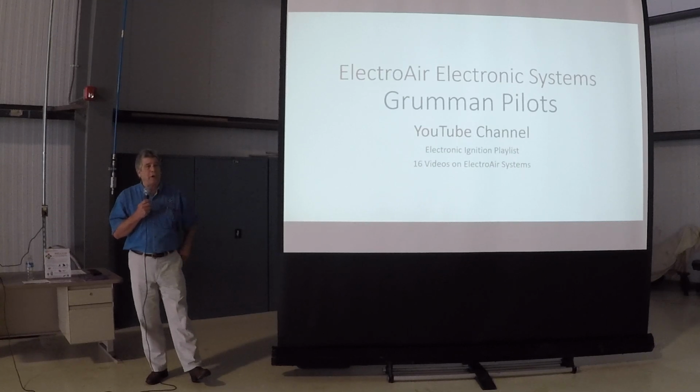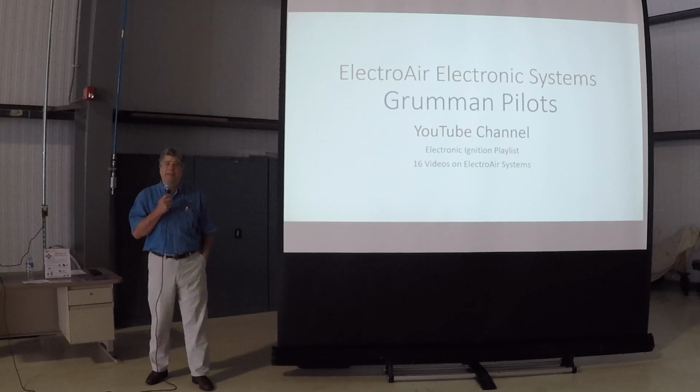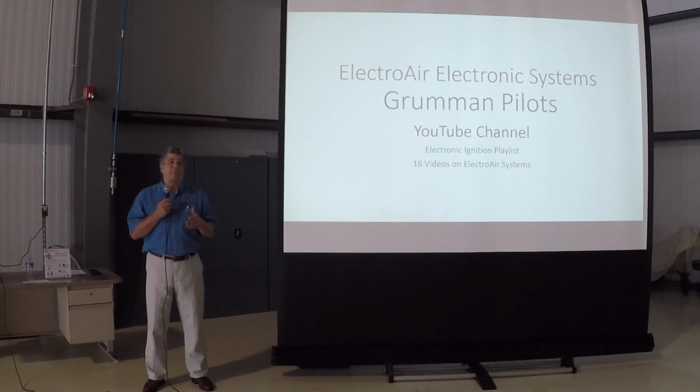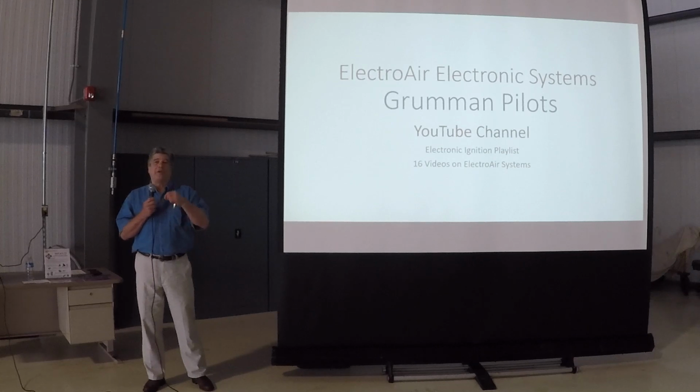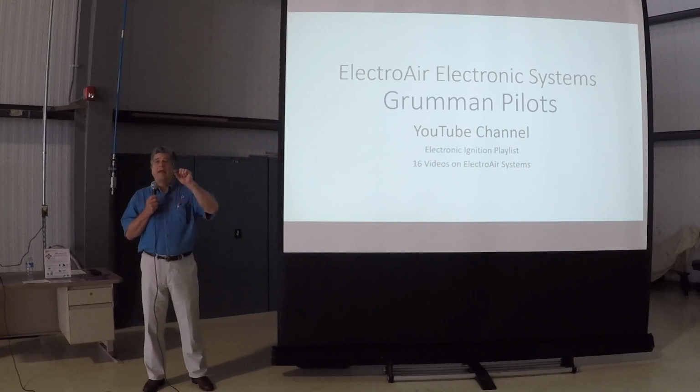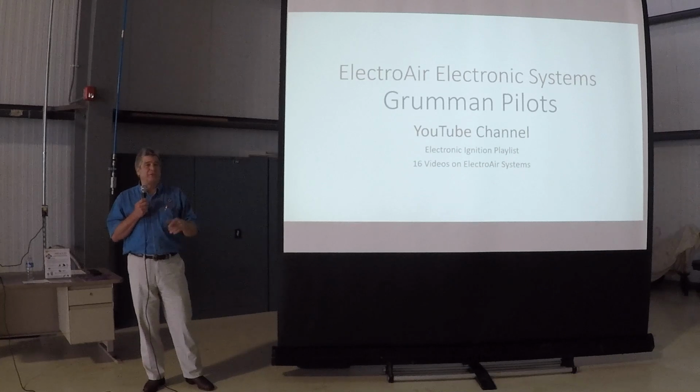I did my first one in April of 2013. I did 11 last year. I've done 2 already this year in a variety of airplanes. And every time I've had a problem, the 2 times that we've actually had one not work when we put it out of the box, we found a wiring error, or we were using a customer-provided switch, and we found the contacts on the switch were grounding. That's why the breaker was popping. We weren't getting 12 volts in the controller. Once we fixed all those problems, they work really well.